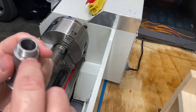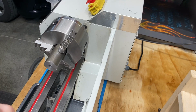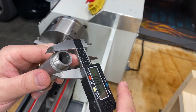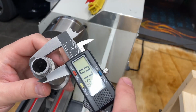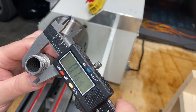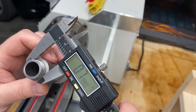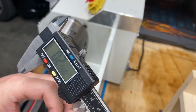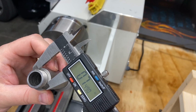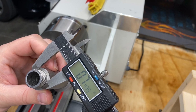The next thing I'm going to do is turn this down to 800 thou. That gives me 40 thou of material to work with later. And to show you, if we look at the flat part that was not threaded, it's 700 and, depends on where you measure it, but 760 thou. 750 thou. Let's do this again. So now it's 750. Anyway, I'm going to go 800 thou,